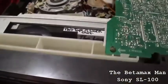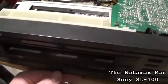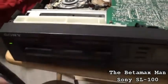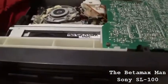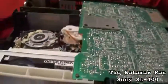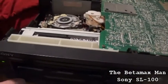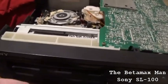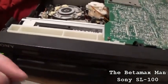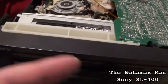We still want to clean the top side too — it's probably sticking to the drum. That's just tape stiction. I'm going to clean the top side and then we'll see how it performs. I'm actually starting to think that maybe the Hall Effect device needs to be changed, because when you go to rewind and fast forward it just seems to be a little slow. But that's probably due to the sticking of the drum. We can clean the drum, and if it's still sticking I'm probably going to have to take the top half of the drum off just to clean it.